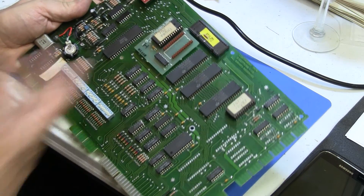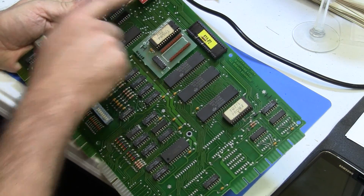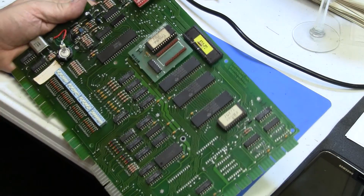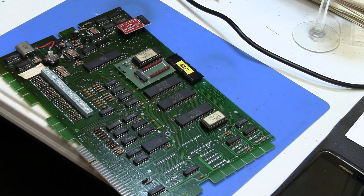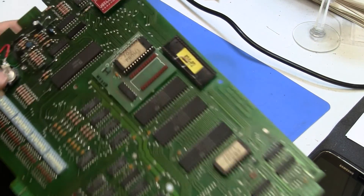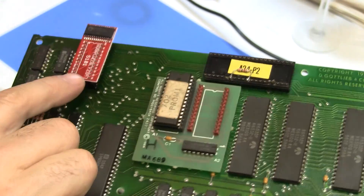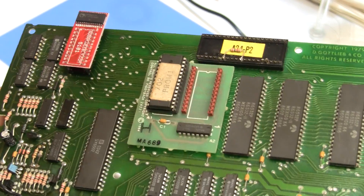It's not too difficult to do this — you just have to be diligent in replacing the chip with a socket and making sure you're very careful about not blowing traces. And there you have it. For more, visit pinballhelp.com. Thanks for watching — that is a Gottlieb System 80 replacing the 5101 memory chip with non-volatile RAM so you don't need a battery.